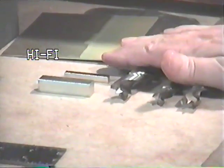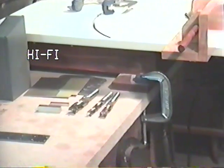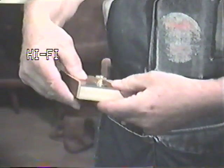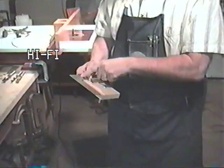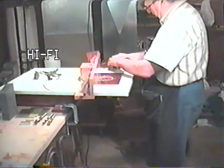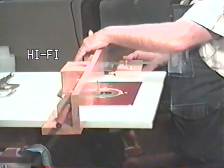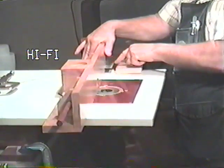So we have all types of possibilities for spacers — keys, other drill bits, sheets of metal. On the other hand, if we would prefer to actually make measurements rather than using spacers, we can accomplish that simply by setting some measuring means on our locating post. We would set the distance to twice the setup distance that we desired, drop the locating post into place, bring the fence up and clamp it, and now we've set the setup distance to half of that space.